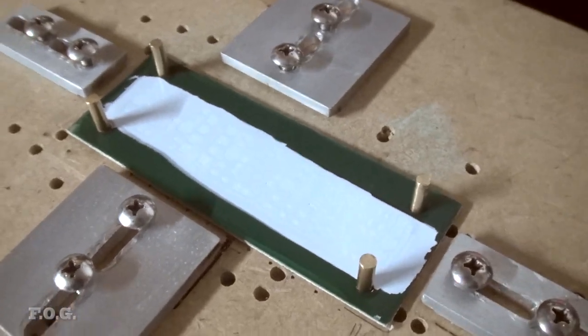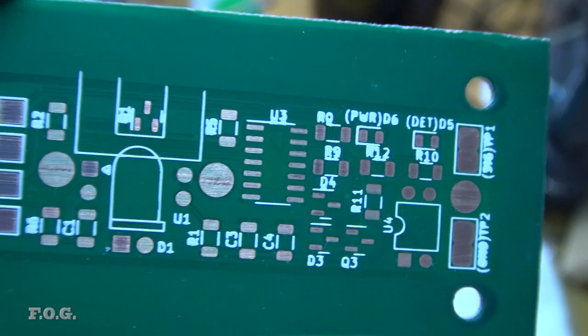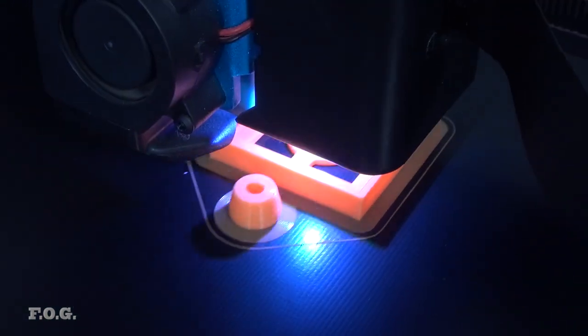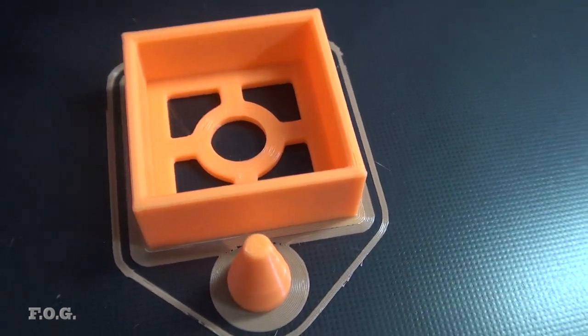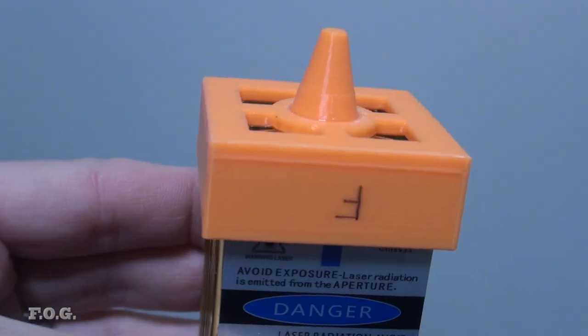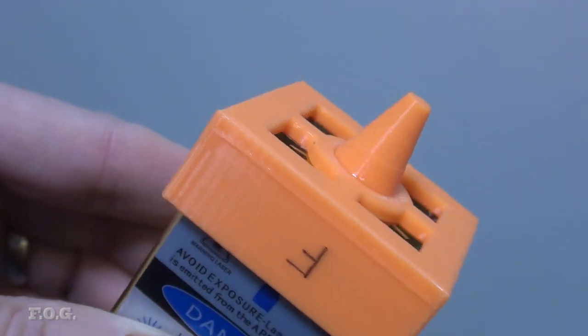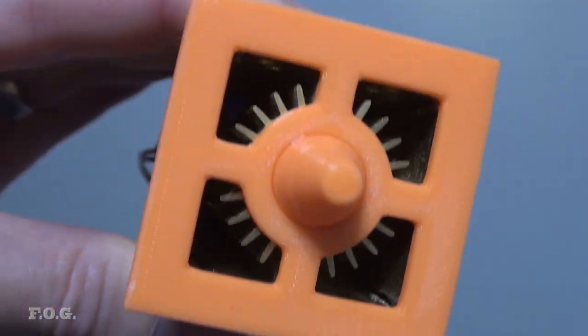As seen in episode 8, I'm no longer burning slots for the white text overlay—instead I'm simply exposing the resin with the laser. That didn't give great results; I suspect the halo light around the laser core is causing exposure outside the intended area. So I made this 3D-printed blinder, which fits to the laser when exposing the resin. It's printed as two pieces that friction-fit together, locked with super glue, and also attaches to the laser with a friction fit. I put an F-mark on the front to ensure consistent orientation, and the cooling fins and fans still work fine.